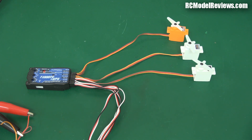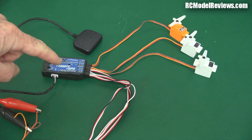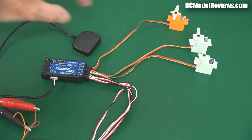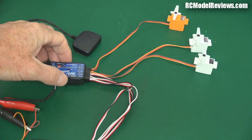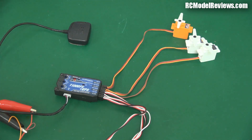Now things get more complicated because we're going to plug in the GPS and everything changes. The GPS receiver is now connected. Going back to what was the pass-through mode - if I move my elevator, rudder, ailerons they all work through, but before the gyros had no effect. As soon as you plug in this GPS, suddenly this becomes a stabilized mode. It's like the third position on the switch without the GPS - plugging in the GPS changes what your switch does, turning the pass-through mode into the stabilized mode. Still no yaw correction though - the pitch and roll are stabilized.